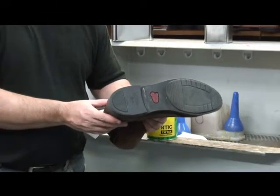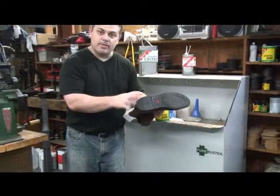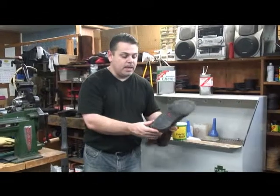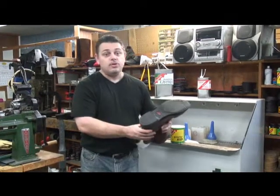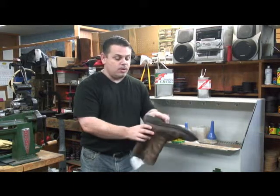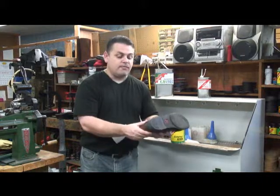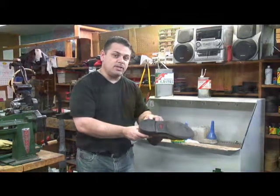We have an open time of 5 to 20 minutes, then we press it together sometime in between that open time. We have a very nice tight bond with no heat. You can reactivate it with heat if you like — that's no problem. As you can see, you're going to have a very tight bond, toluene free, MEK free, and it's clear.